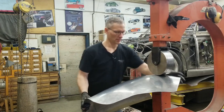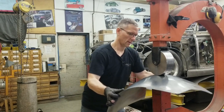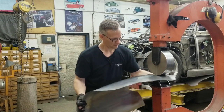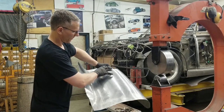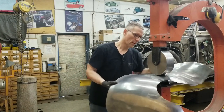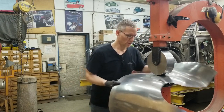This is a very complicated panel — a lot of stuff going on. I'll just wheel up this zone here around the headlight to stretch it out a bit, and that'll allow some freedom for us to move inward, and then we'll increase the curvature of that reverse curve. We have to stretch this out, so I'm going to switch over — let's try with that anvil and see how it behaves. We don't want to introduce any wheeling marks to the panel at this point because we are sitting quite well and we don't want to work it too much more. That flat, low-crown anvil will do what we need it to do.